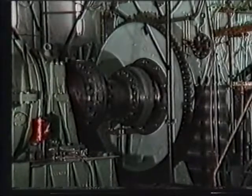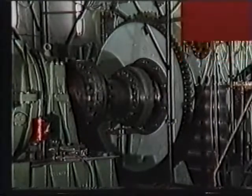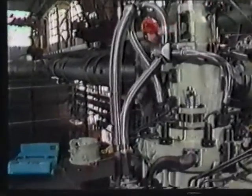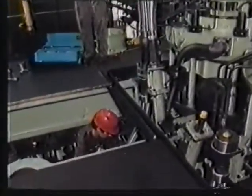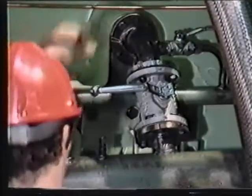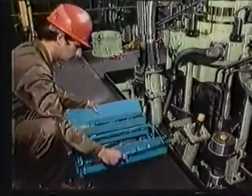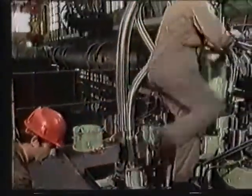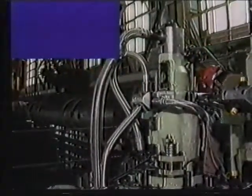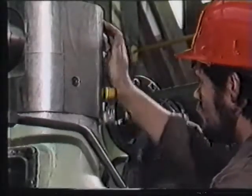Firstly, the engine is shut down exactly according to the operating instructions, page 31. The engine is drained of cylinder cooling water according to Maintenance Manual Group 270, sheet 1. Protect pipe connections from dirt and damage.